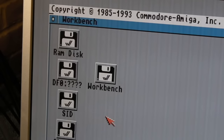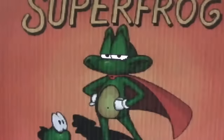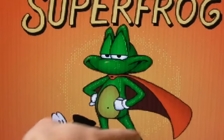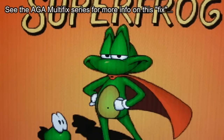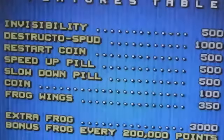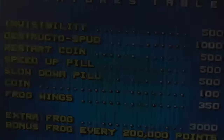If you see the link top right, you'll see the exact same glitches from the AGA Multi-Fix video. I'm seeing the same speckling — not quite as prominent but it's speckling. The key is when the frog turns up there's like a ring around him. That's horrendous. And the same fix — watch — perfect. Remove the fix and it's back. So the problem in the AGA Multi-Fix video was not the card — it's not a deficiency in the card design. It's a deficiency in the A2000.